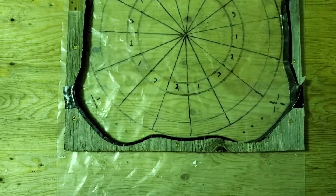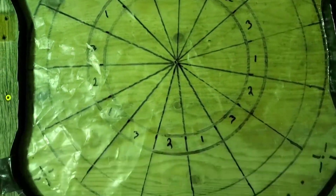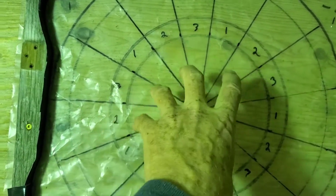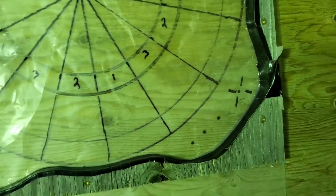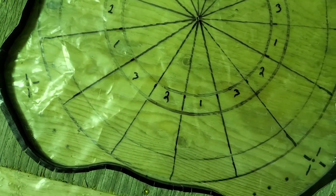Making an update on what I've been doing with this turbine. That's the beginning of the mold for the stator — just have to cut the center out here and put it in. It's sealed and taped all the way around the edge. Three-quarter inch plywood, same as the last turbine I made, where you can put the coils in star or delta just with a switch.